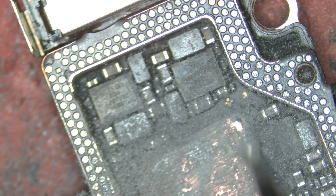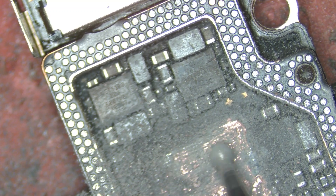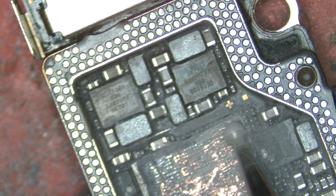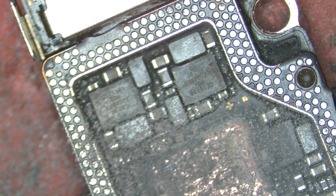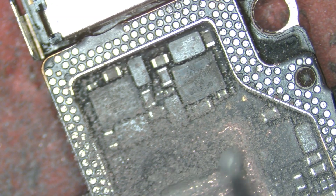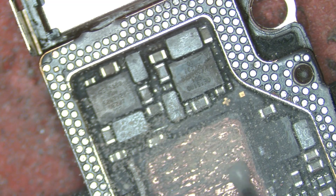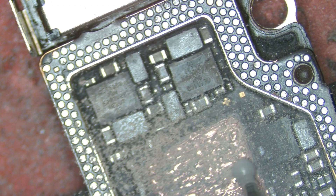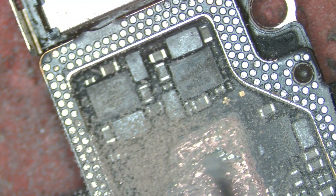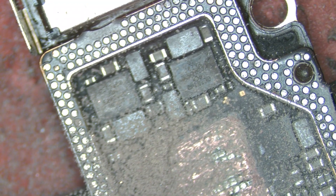I change now the tip to a smaller spherical tip. You can see this is like the lower layer of the module. When you get to the brass or copper, that's the last layer — and after that you'll see the pads should be silvery. Be patient — you can see the copper is removed and the silver is shown.